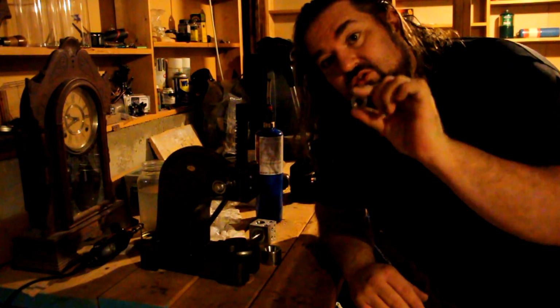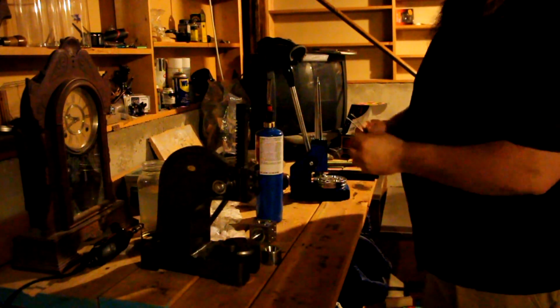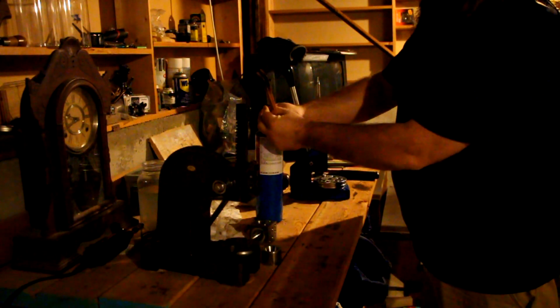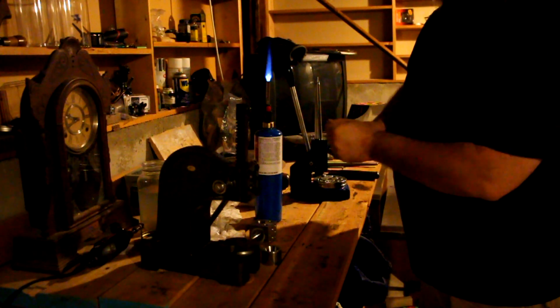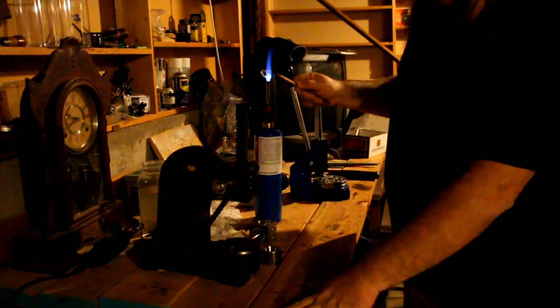the coins themselves do not harden. They'll stay malleable even after you cool them. So this process right here is very, very important. So what you do is I got my little copper tongs here, and turn on our blowtorch. It takes about 30 seconds, sometimes less, for the quarter to heat up. You want to get it just to the point where it's glowing.